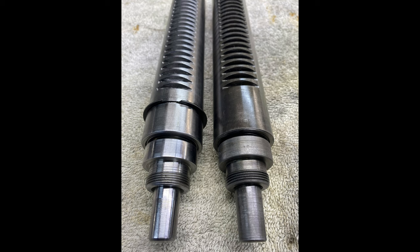One of the most significant changes between the 100 and the 150 series drill presses is the addition of a retaining ring on the quill. This is a side-by-side view of the quill spindle assembly from a 100 drill press on the right and a 150 drill press on the left. Notice the retaining ring on the 150 quill. This is a significant change because it prevents the feed stop bracket from slipping and allowing the quill spindle assembly from traveling too high inside the head casting.